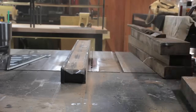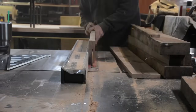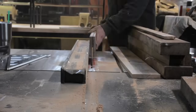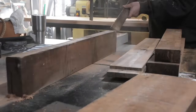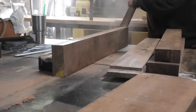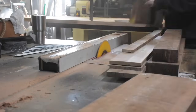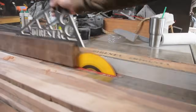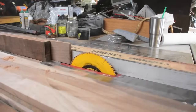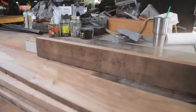Now I'm splitting the wood into thirds, or resawing it. I cut the actual width to close to six inches so that I could then cut it from both sides on the table saw. Because I'm going to mill this wood all the way up both sides, to split it all up and pass it through my planer I had to mill it down to these various sizes. Ultimately, the various pieces of wood become part of the graphic of the finished piece.